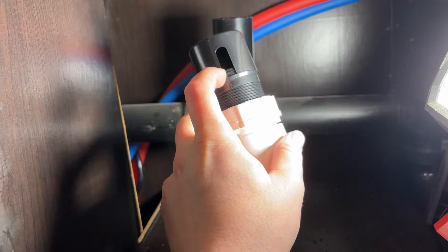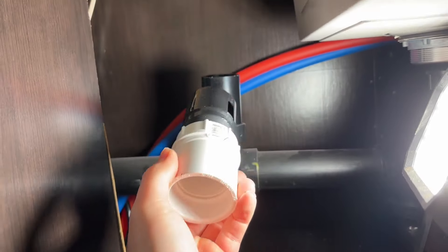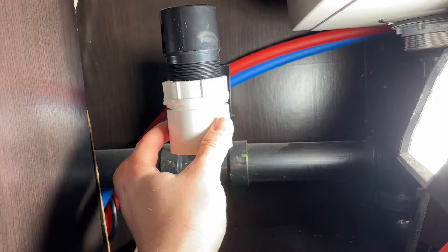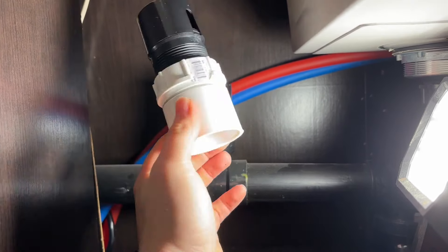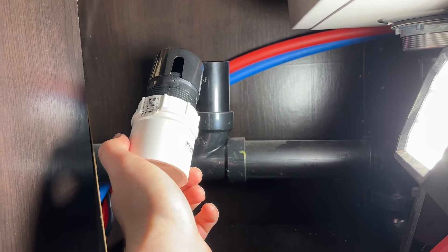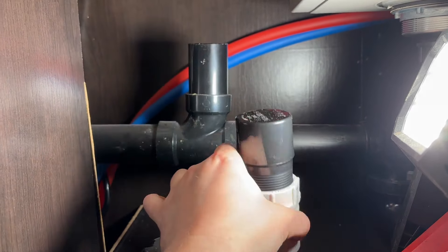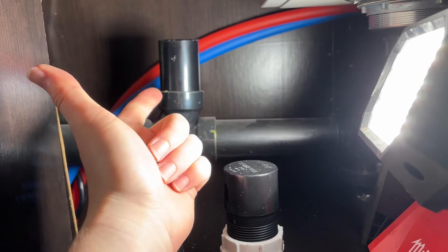It's allowing sewer gas back in, so you definitely want to replace it. If you've got the weird style like me — the glued-in ones — you have to cut that pipe off to get on a coupler with female threads and then put on a male-thread air admittance valve. It's really not complicated; the hard part is just cutting off the old valve stem, then you throw on the new one and it's very easy. Links in the description for the parts I used — have a great day and stay safe out there.